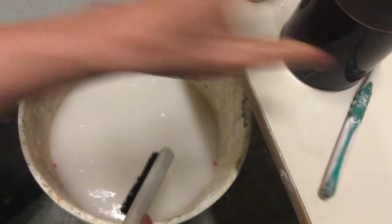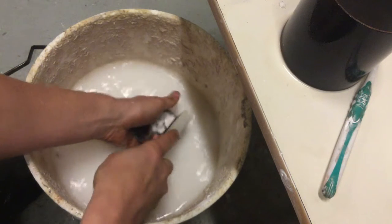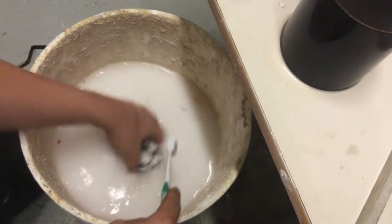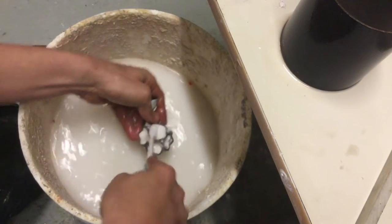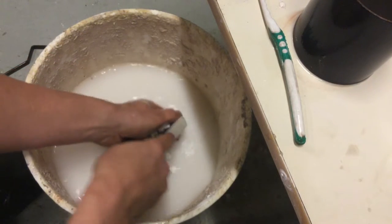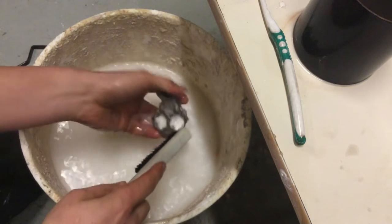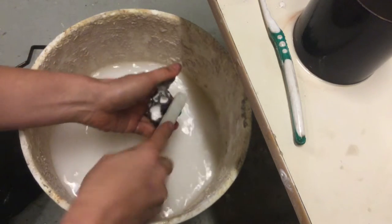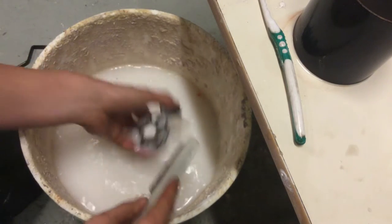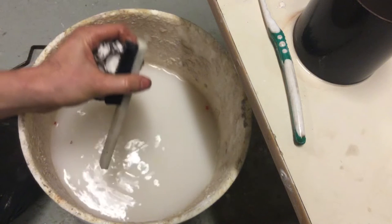So there's our clean flask, and then we have our printed part. You can scrub that with the nylon brush, and then when you get most of the details out, you can switch to the toothbrush. Each time I'm dipping to make sure any excess plaster that may be floating around comes out and allows more access to surface details. It's a dip and a swishing motion to get most of that remaining plaster out very quickly without a lot of work. Then for really high details, it's good to come back with a small needle tool or a dental pick if you have one, to make sure that all the subtleties in the printed part get cleared. I'm going to switch to time-lapse for that, and we'll do the rest.